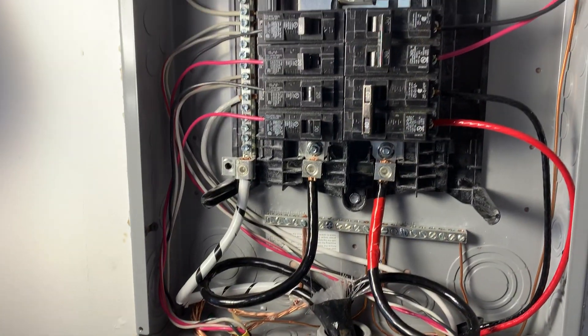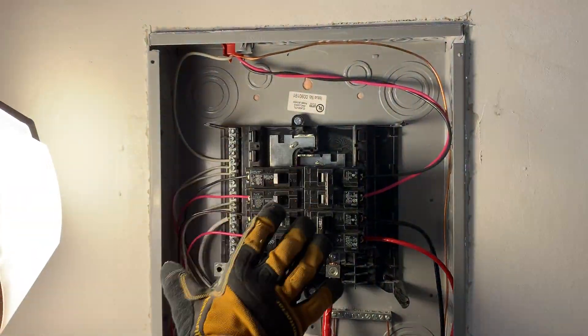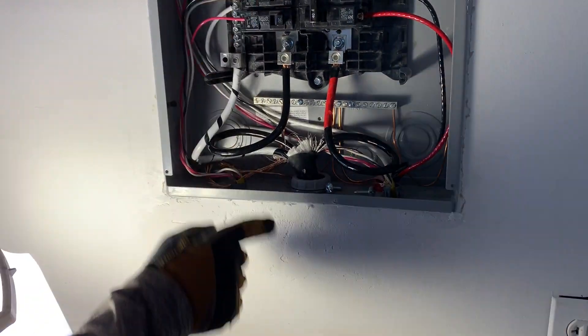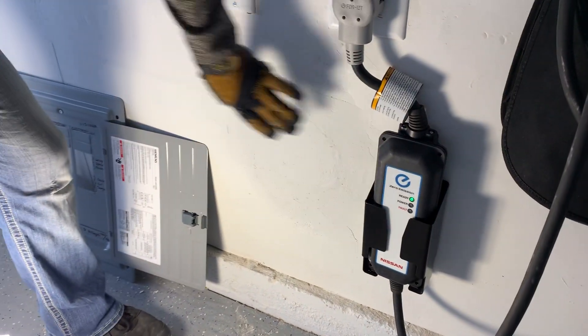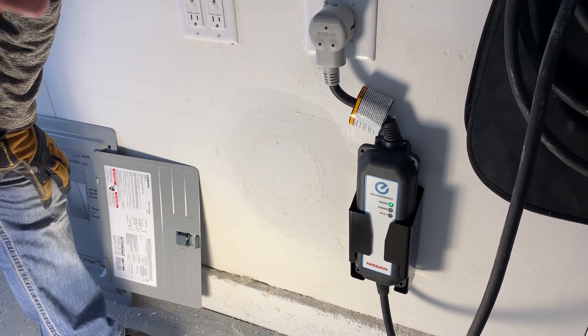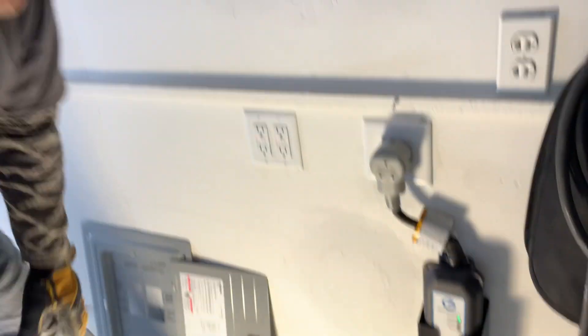I did flip the panel upside down. I didn't make it flush — I put some insulation behind it because that's the bathroom wall. I did mud because once you put this panel in, it always cracks the drywall with that cable. So I mudded that over, then drilled a six-inch hole here and mudded that about four times to slowly get that to go. You guys said I wasn't able to mud — I'm getting better, starting to work on it.